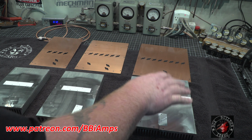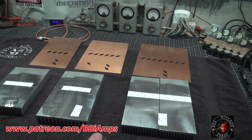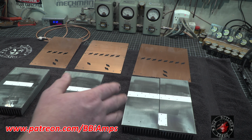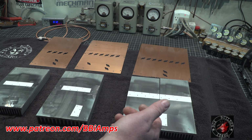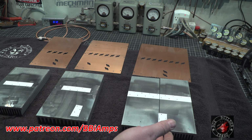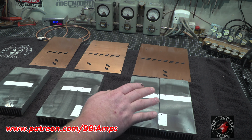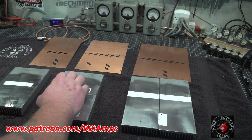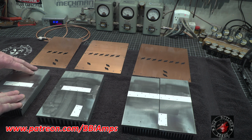So this one is just a straight out 2x8 biased, because this gentleman happens to be from the deep south, let's just say, and he utilizes sideband a lot more than the rest of us do. So we're going to, of course, give him the external auto key circuit. We're going to give him a really good sideband delay. This guy does not care anything about sideband at all. This is straight Class C whoop ass that we're going to build here for him. And this one's a masterclass build. It does not have a home yet.